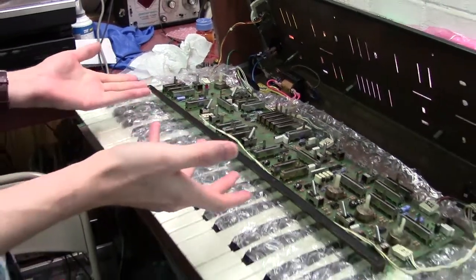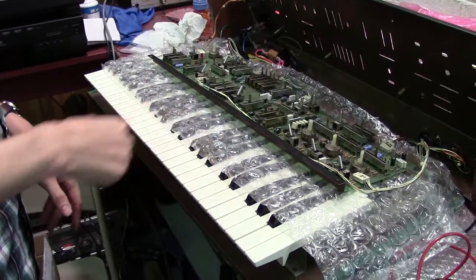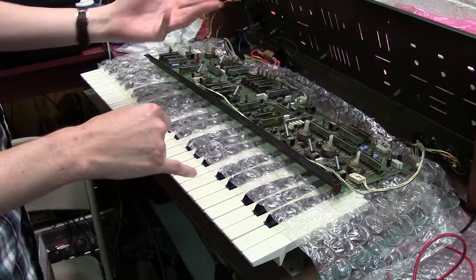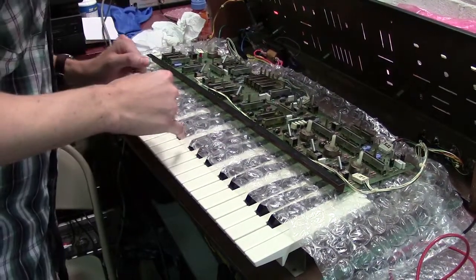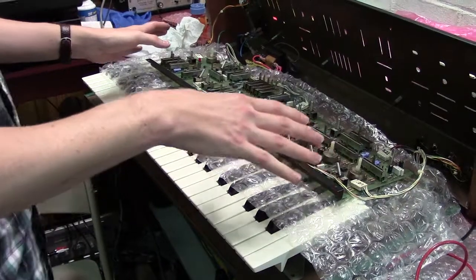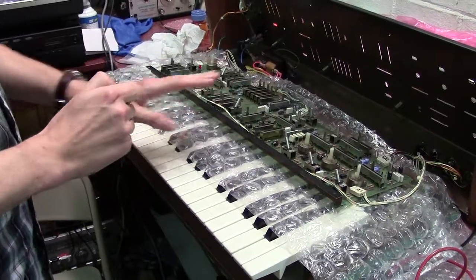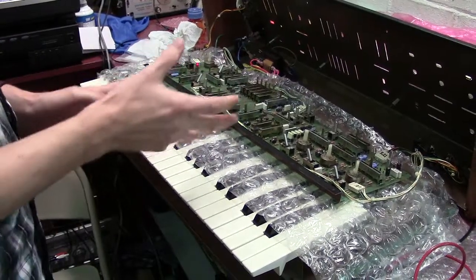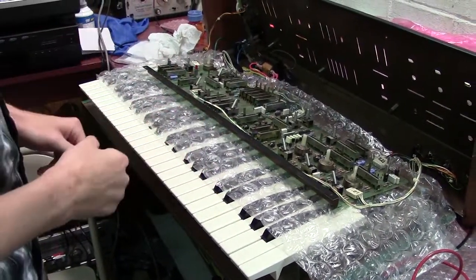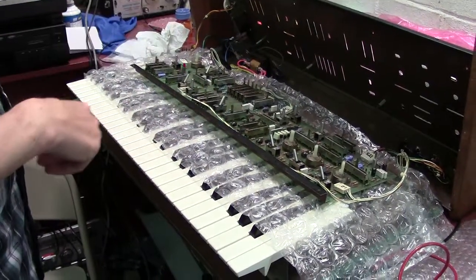The rest of the things I've been working on: I've replaced the divider chips for your D-sharps and the one for your E that was missing ranks of the drawbars. I cleaned all your sliders as well and they're all nice and smooth. The only thing I'm waiting on right now is I've got all new capacitors coming, just to do a preventive maintenance kind of thing — just to make sure it lasts another 30 to 45 years for you.